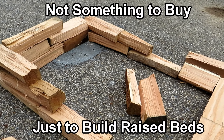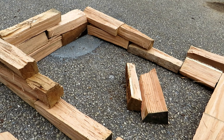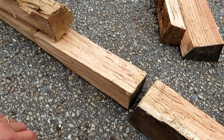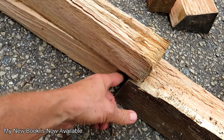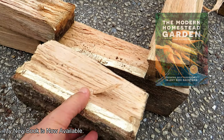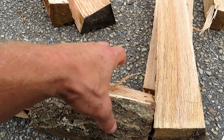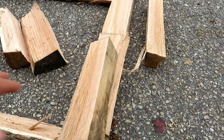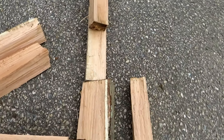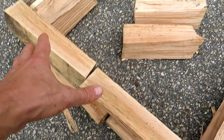I want to stress that it's not economical to go buy a log splitter just for this. But if it's something you need on your homestead and you're burning wood, this is a great way to build something pretty rustic looking. What you're doing is overlapping your cut firewood where the joints meet. If you have to leave a space to make it work out, that's perfectly fine. The rectangular cuts really do help. If you need a triangular piece, you can balance another triangular piece or just go across with a rectangular piece. It doesn't have to be perfect — this is a rustic design. We keep overlapping the wood, and then the nail goes here and here to secure it.